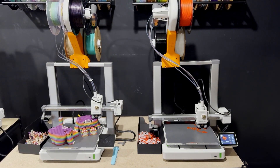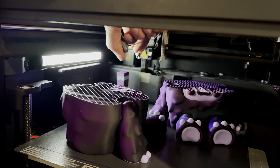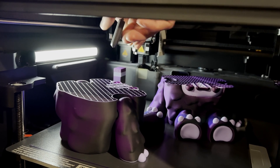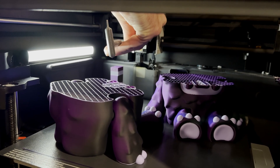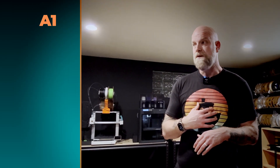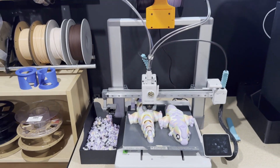The A1 is open — pop the front faceplate off and the nozzle is right there. The P1S also requires a full hot end assembly where you have to thermal paste the thermistor, which you don't deal with on the A1. On the AMS side, loading filament is easier on the A1's AMS. I do notice more motor slippage on the A1 units, but I have 12 A1 combos versus only 4 P1S machines, so that's probably why it's more noticeable.